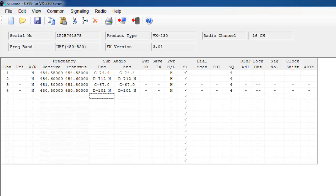Common features that you might want to program into your VX-231 radio include scan. To make sure each channel is set to scan, take a look at the scan column. If you have a check mark in the scan column, that means that channel is okay to scan. You may also want to check your power column for high or low — you want it on high for more power. If you want to convert it to low, select the channel and hit the space bar to change it to low; hit the space key again to change it back to high.